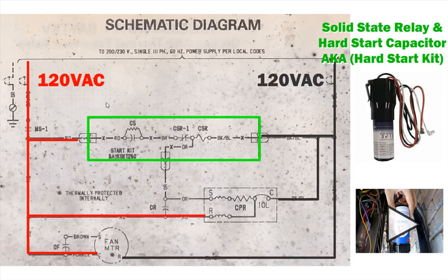Now we have 240 volts AC energizing three components: the hard start kit, compressor, and fan motor. The hard start kit is optional. The reason it's optional is because it's used when you're low on voltage at your house — you don't have your full 240 or 230 volts AC, you have a little bit lower voltage, and it's not enough to kick start the compressor. The main use of the hard start kit is to kick start the compressor when voltage is low.